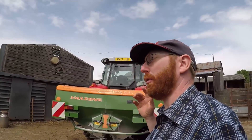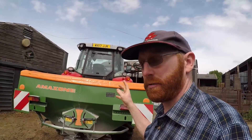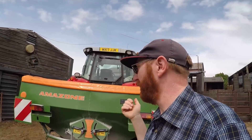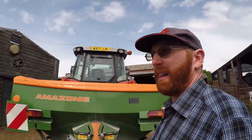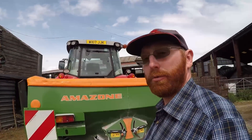So there we go, all finished. The mapping system said we covered 13.2 hectares, but we've added up the actual field sizes and the actual area covered was 11.1 hectares, so it's not far out. It's just those headland turns constantly being counted - without pressing the screen to stop it, it thinks it's spreading all the time when in reality it's not. But for what we're doing it for, which is the guidance up and down, there's no need to worry about pressing buttons. Time will tell whether it's accurate - it's new and he's still trying to get used to it. So thank you very much for watching, and we'll see you next time.